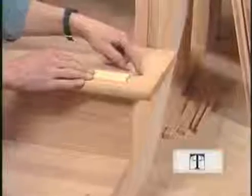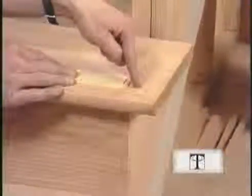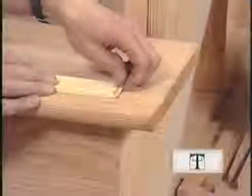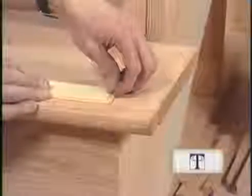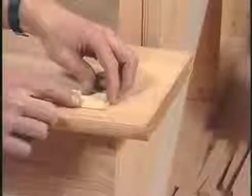I'll get my cut line across here and lay out a 45. I'll saw the cut with a table saw and hand saw the 45. Then I'll put the nosing on later. The width of the nosing, the overhang, is the same as the overhang was on the front. Put the tread tight against the house skirt board. Make a mark flush with the edge of this skirt board.